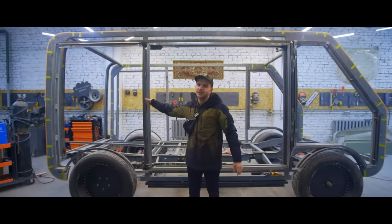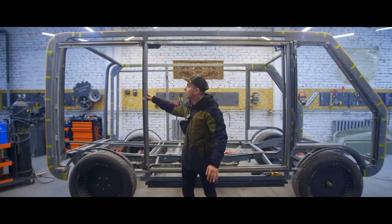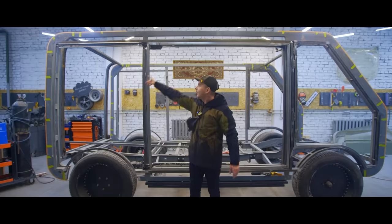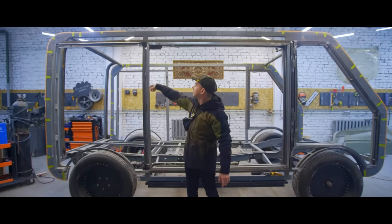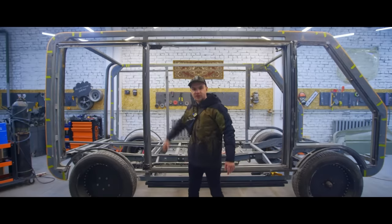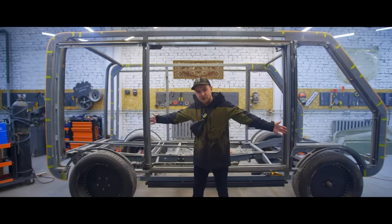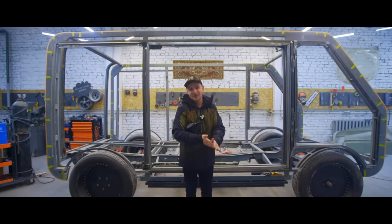Hey, it doesn't make any sense. The physics won't allow you to do it this way, because to push the door, keep in mind that each van has the drive in the middle, and you're gonna install it up there. So if your drive pushes only the top part of the door, the lower part will go in the opposite way diagonally. What's the conclusion? The door will jam. That's not it, guys.